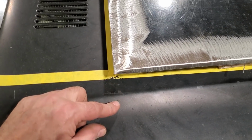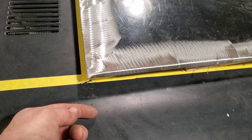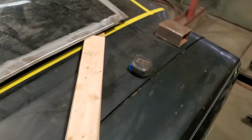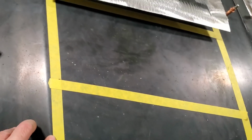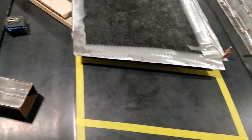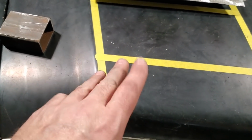The issue that I got here with this body line, I've noticed in the pictures that the outside edge is extremely tipped out more than it is on the inside edge, which is good because I might be able to fudge this now and have this taper back and just leave that line there. And this one up front, the way it comes forward, it comes out past it, but it comes to a point up here somewhere. So I might be able to just bring it to a point right on that crease, which would work out fantastic, because then the crease would just continue on up to the front of the car. I might soften up the crease after the fact, I don't know. I might roll it off, because the original 442 hood is changed a bit, right?